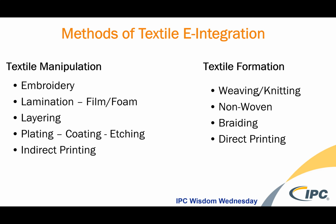An example of that would be a silver-coated fabric. That fabric largely would be nylon, and the silver coating would stick to the nylon in the electrochemical plating process. But if you made that fabric nylon and polyester, then the silver would only stick to the nylon, and therefore anywhere that you have polyester, you could create a pattern of non-conductive areas. And, of course, by the way, creating patterns of conductive areas.